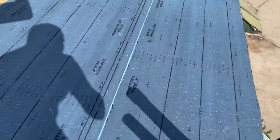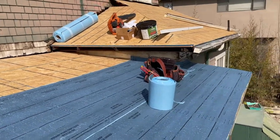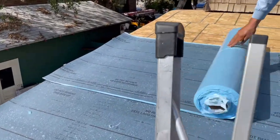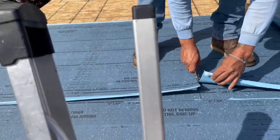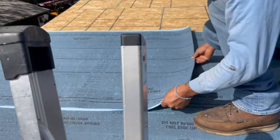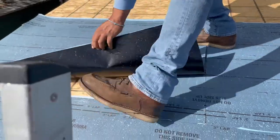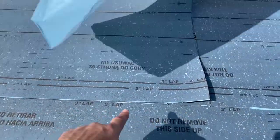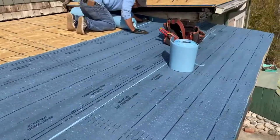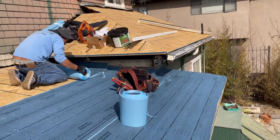When doing these kinds of flat roofs, you really want to make sure you spend all your time, attention, and detail there. Shingle roofs tend to be a lot easier to work on, but flat roofs definitely require more attention to detail. You can see here we're at an end lap where two ends are meeting. The manufacturer calls for about an 8-inch overlap at the ends, but we like to go more — a minimum of 12 to 14 inches. It doesn't hurt to go more; you're just using a little extra material, but it's always better to go more at your end laps.